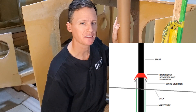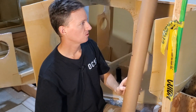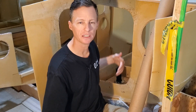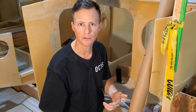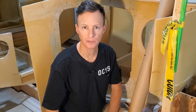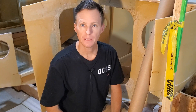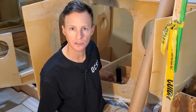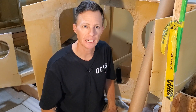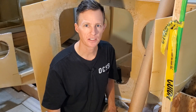But how do we deal with what little water does get inside the tube? Well, one thing that some designs do — like the Paradox sailboats — they put a drain straight through the inside of the tube through the hull down to the ocean, so any water that comes in collects in the bottom and drains down to the ocean. I don't really like that because that hole can get clogged with marine growth, and if the bottom of your mast tube should break in some kind of freak accident, well now you've got a hole directly to the ocean where water is going to pour in at an alarming rate. My preference is to put a small hole at the back of the tube inside this compartment. Any little bit of water that does happen to get in there is going to drain into this compartment and I'm comfortable with that — I can just take a sponge and clean it up. It's just my preference not to have any holes in the boat under the waterline, such as through-hulls or drains.